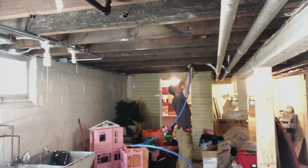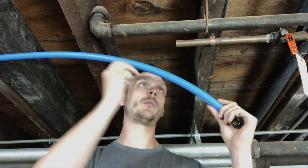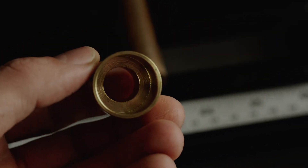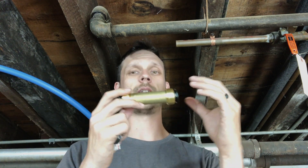Once we've run the old work all the way to our new work we are ready to make the connection. Our PEX tubing is coming in, and we have our old copper — we cut this a little bit long because we have a little bit of extra. To make the connection between these two there are a couple different ways. There are solder-on fittings, where you would solder a PEX fitting on the end of the copper and then slide the PEX over it. We're going to be using a slip fitting — also called a push-to-connect fitting. This one is a little bit longer than your standard one; it's actually meant for a splice where you have a cut on one side and a cut on the other and you slip this over. I don't have a shorter standard one with me and I'm not going to run all the way back to the store, so I'm just going to use this for this application — it should work just fine.